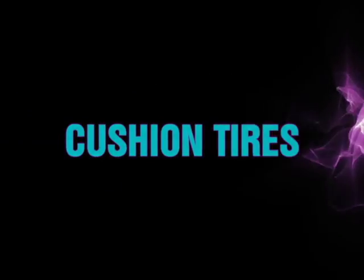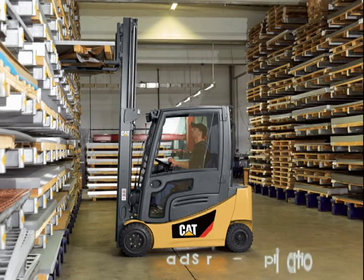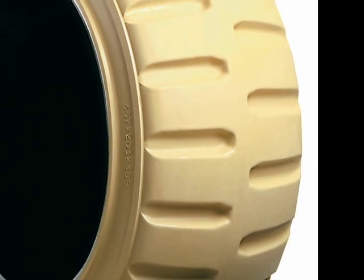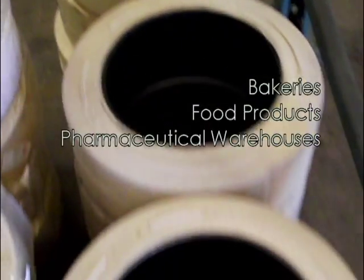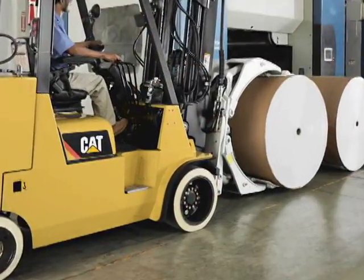Let's look at some cushioned traction and smooth tires. There are three basic cushioned tires to consider. One is an electric type tire, regardless of fuel type — these are used on hard surface applications. Non-marking white tires are filled with a synthetic compound which replaces the black compound, usually used in bakeries, food products, or pharmaceutical warehouses. A multi-class tire is a high performance, low rolling resistance option, ideal for most applications.